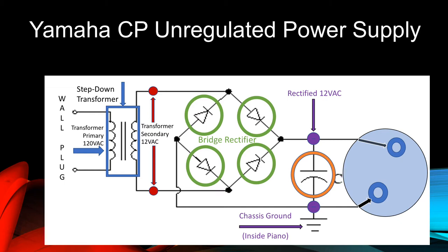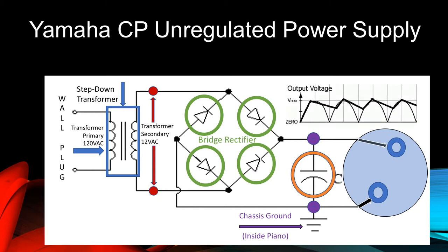When a DC voltage is applied to a capacitor, its plates will charge to a value equal to the applied voltage. It acts like a temporary battery. If that DC voltage then decreases, the capacitor will discharge to maintain the previous voltage level. If the applied voltage fluctuates up and down, the capacitor will charge and discharge because it opposes changes in voltage across its plates, smoothing out the voltage fluctuations and stabilizing them. The resulting smoother waveform is shown in the picture by the thick black line.